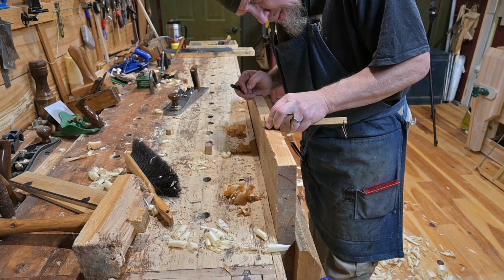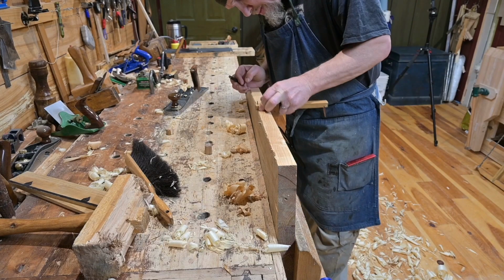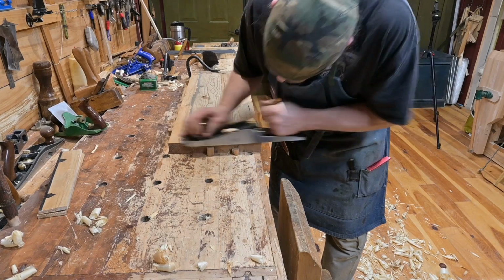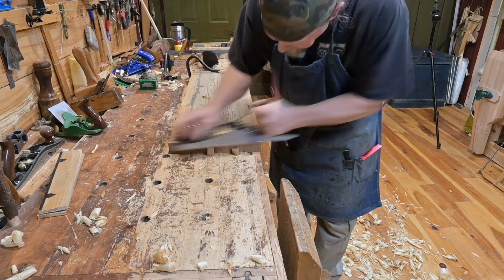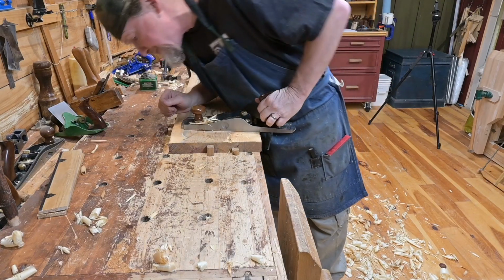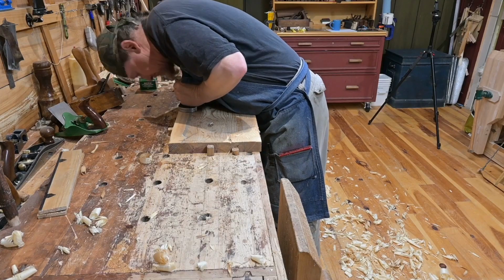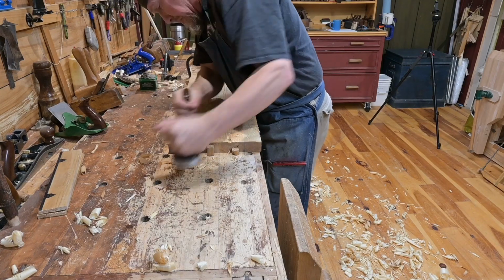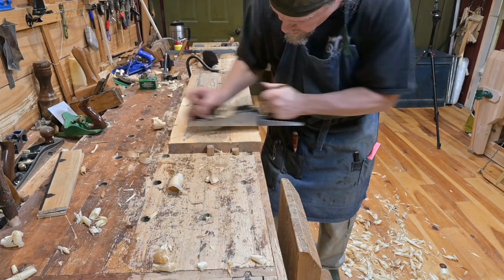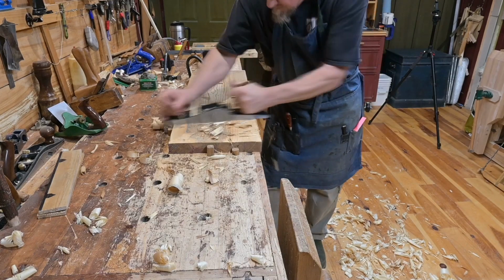Tom is just scribing the depth of the wood here. This is so he can plane off the irregularities and clean up the surface. Tom is now planing down to the depth that we marked. And you'll notice that caulk mark on there. The caulk is no longer on there because I scraped it off earlier. It's just dirt and grime. Because we would never run our planes over some kind of rough caulk. It might have even been construction adhesive, I don't know. But they were on the old stair steps to the basement, which we of course replaced.